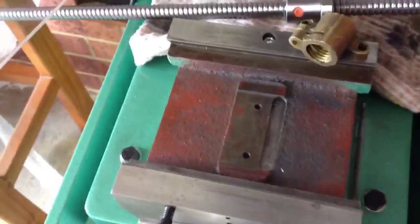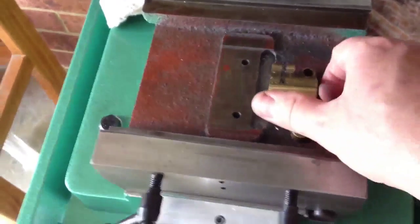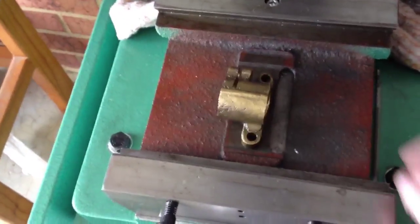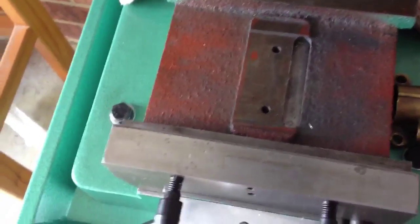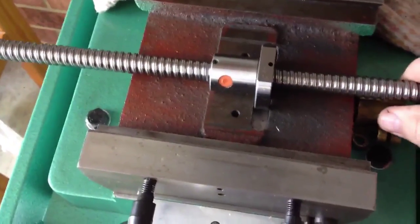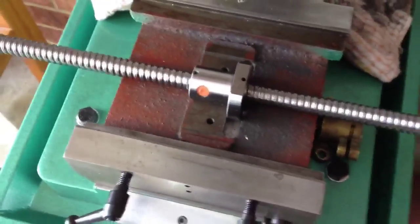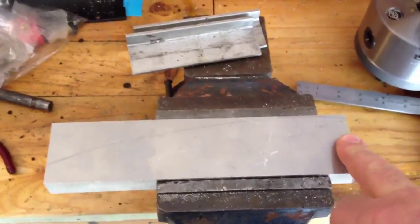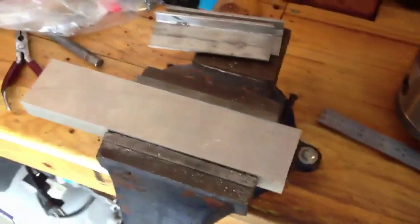I'm currently making a new nut to go on here — this is for the X axis. The original nut sat in there like so, and my new nut to replace it was made of aluminium. It's to go around the ball screw there to encapsulate that round part of the ball screw. To do this I've cut a big chunk of aluminium out of some bar stock. Just go to your local scrap merchant and grab some of that stuff — it's usually cheap, sitting on their shelf.